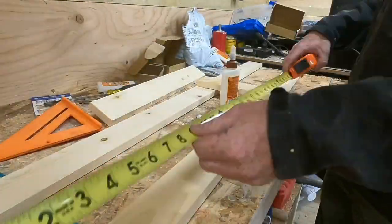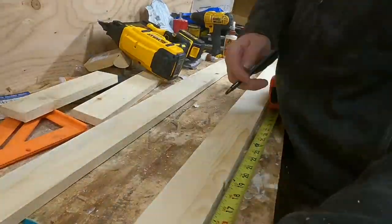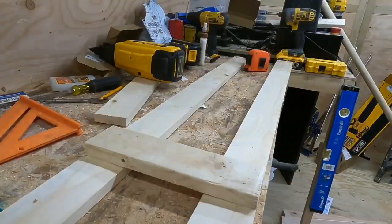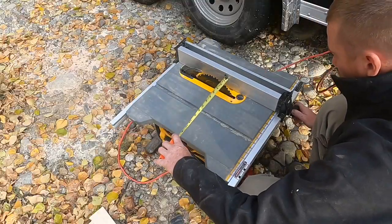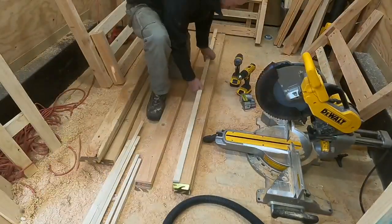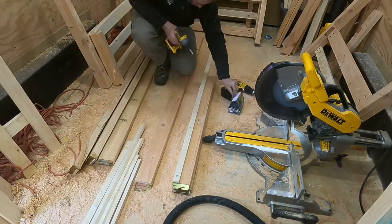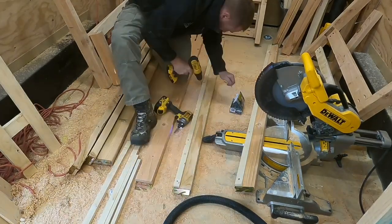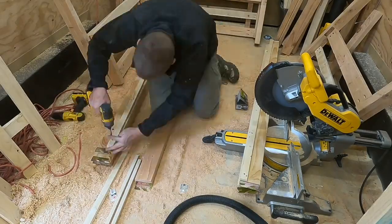I'm going to cut two 1x3s down to 55 inches, two down to 40 inches, and a total of seven cut down to 9 inches, spacing them 14 inches apart — a nice, easy bed rail system so they don't roll off the bed. I'm going to rip a 1x3 down the middle twice, which will allow me to put some slats for the mattress to stay on. I'll pre-drill and screw these into the bottom of my 2x4s, and cut a total of 18 slats at 37.5 inches long.